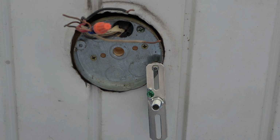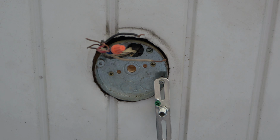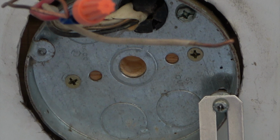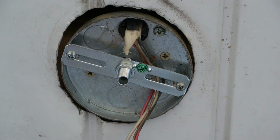It's true that I could have cut the rod size down using a hacksaw, but that would have damaged the threads. Then I'd have another issue. So drilling the hole really solved the problem. I then installed the threaded rod. It now had enough room for depth adjustment.